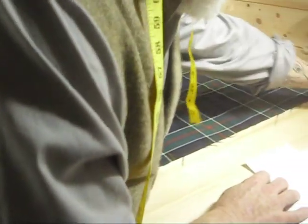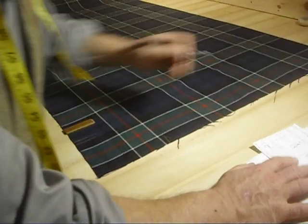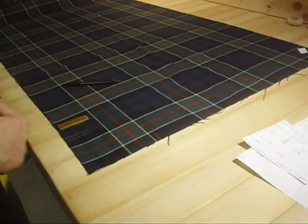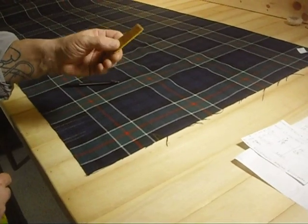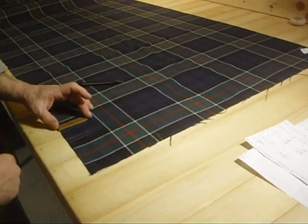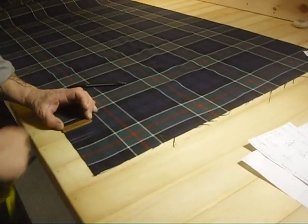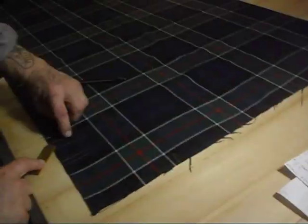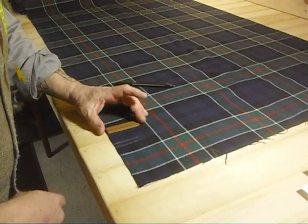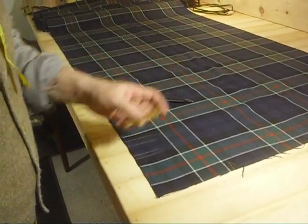Incidentally, my shorthand with this is going to be 3/4. Because if I can do this in graduations, rather than having a million of these things graduated in 16ths or 32nds, I've got a 3/4. 3/4 plus is the width of this plus the thickness of one chalk line. 3/4 plus plus is this thickness plus the thicknesses of 2 chalk lines. And I will double check that with my tape, counting out 16ths. But I've checked it and it's right.